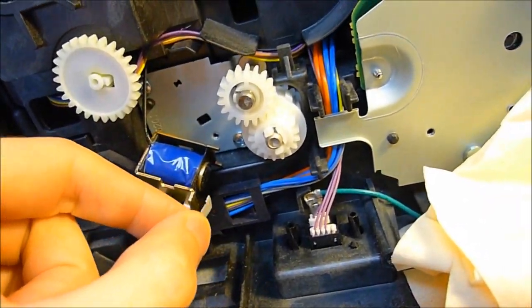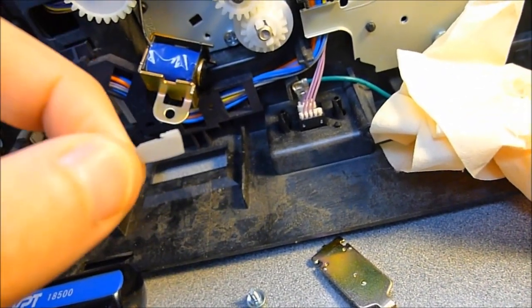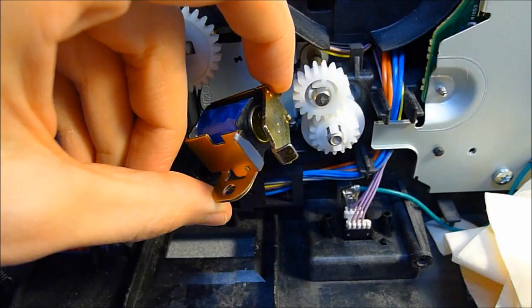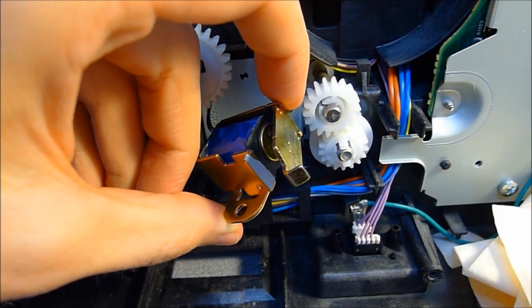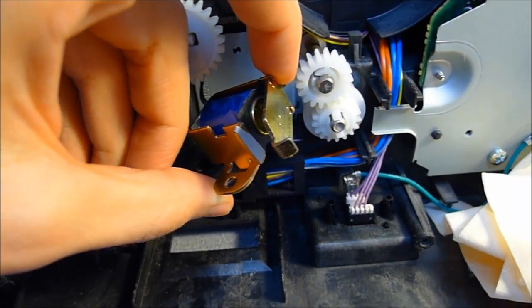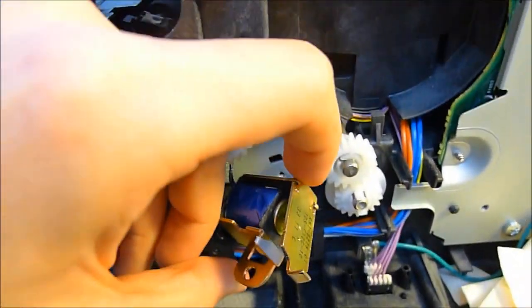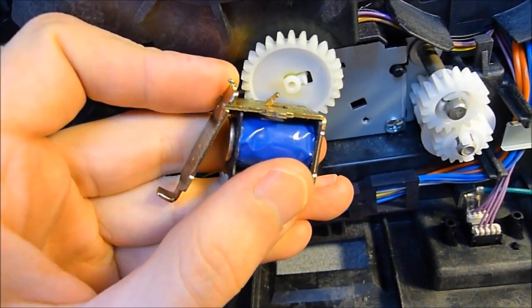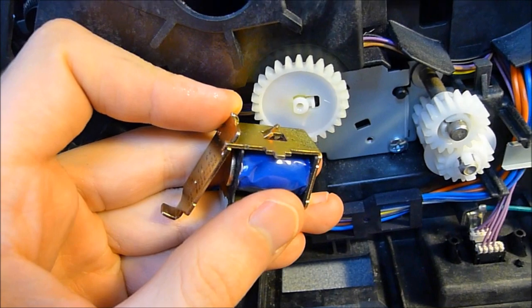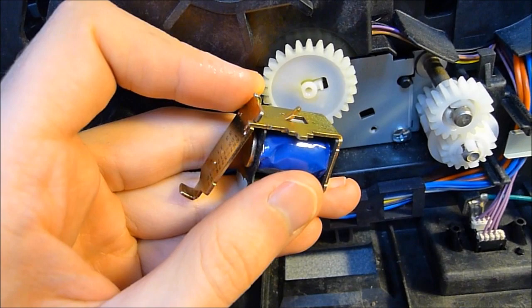So what I'm going to do is stick a little piece of tape back onto there. Now, as you can see, that's what it looks like with my little gray piece of electrical tape stuck on there. Go ahead and put the spring and the screw back into the solenoid and hook it back in. Just be very careful when putting the spring back on — I would suggest doing it from this angle, otherwise that spring is going to act like a rubber band and shoot off into far corners of your office, which has already happened to me twice now.